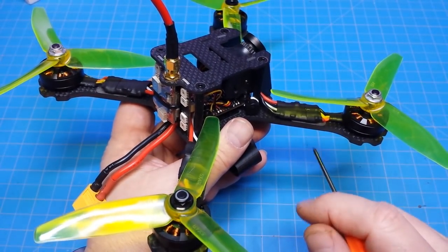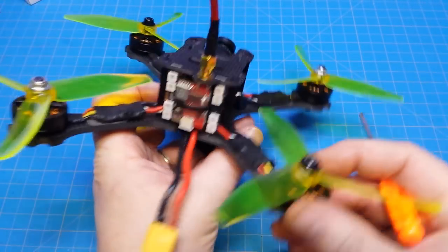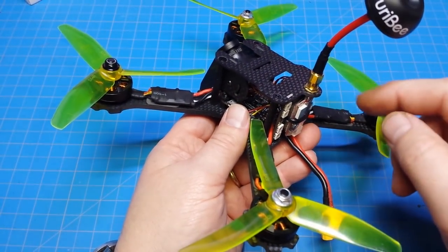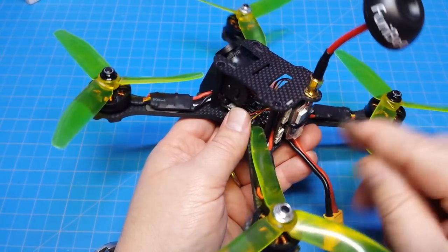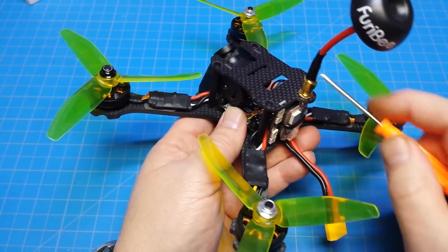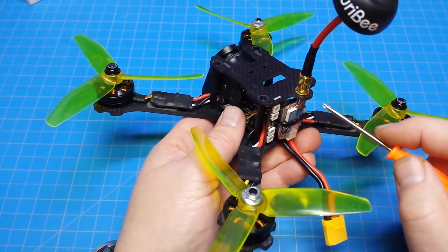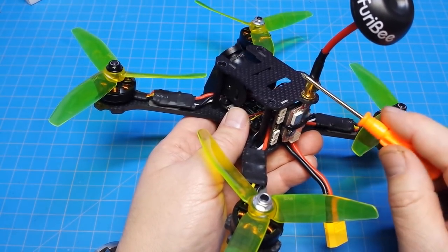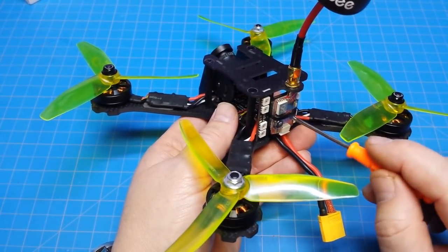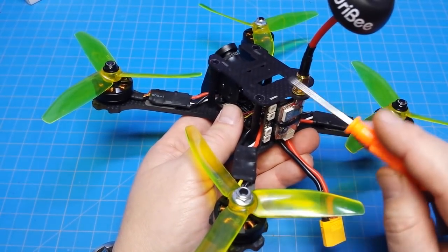They've covered the ESCs with heat shrink, and there's some extraordinarily sticky tape on all four sides. They've also not just loosely mounted things — the antenna is actually protected. They have the carbon fiber top where it loops around, so damage is likely going to be on the antenna and not necessarily to the SMA connector for the VTX. We can carry extra antennas to the field and swap them out very easily. But if you snap off your VTX, at the very least you've got to cut your zip tie, disconnect, and have another one to reconnect everything.